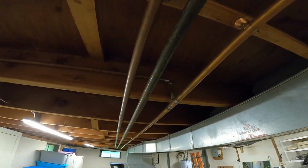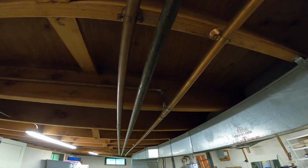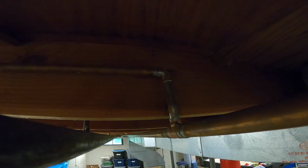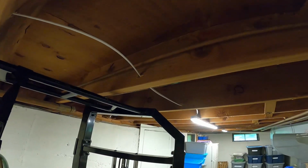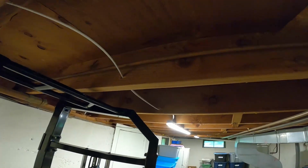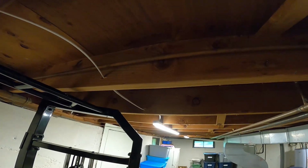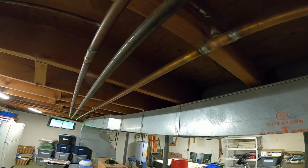All right, so we're down in the basement here, and I noticed when looking under the kitchen sink that the dish machine is actually fed from the hot water line, not the cold water line. So it's coming from this guy here. See that? So I'm going to show you how to get rid of that. I can actually hear this from upstairs on the second floor when it's doing that. Essentially, it's shaking the hot water pipe, and that vibration is traveling through all of the hot water piping downstairs here.